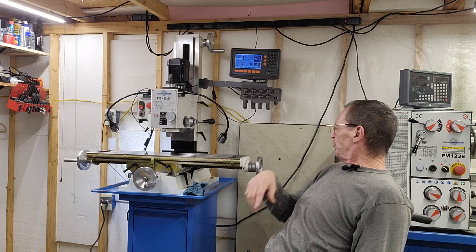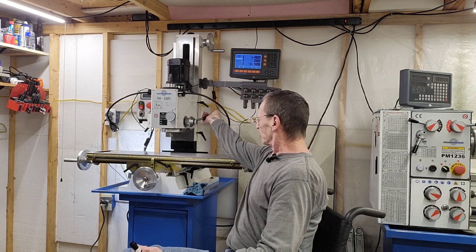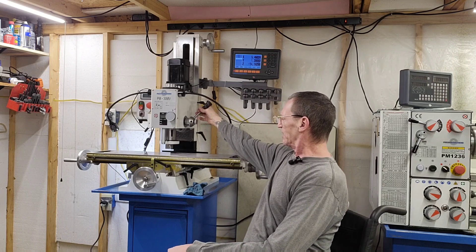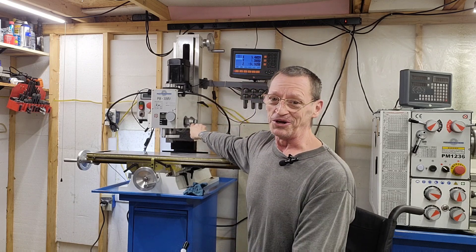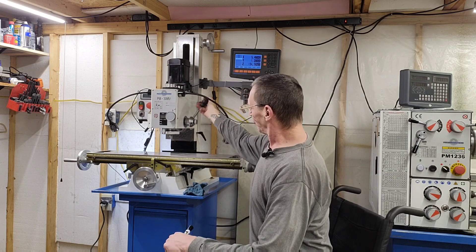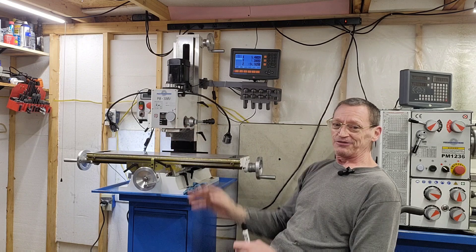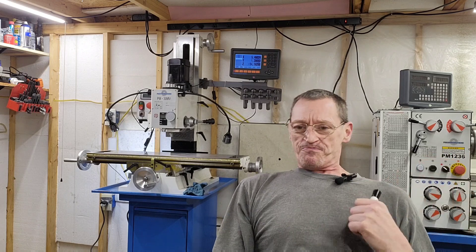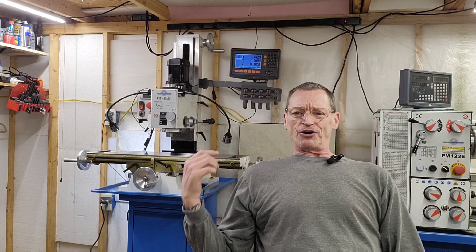She's smooth as glass everywhere. When I first got the mill it had a sticking quill — the quill would stick. It has three inches of travel. You could run it down and it would stick. But today it's broken in nice. I actually don't remember when it stopped sticking, I just dealt with it. Now it's smooth as glass. I keep that quill oiled and clean. The fine feed works smooth as glass and it's accurate. The lead screws on this machine are deadly accurate. It's an insanely accurate machine. I've had to do a little tuning — getting tram perfect — but with the work I put into it, I have a fantastic milling machine. It broke in very, very well and all the ways are beautifully broken in.